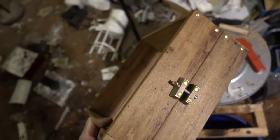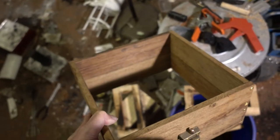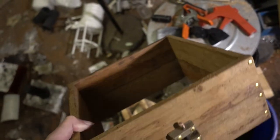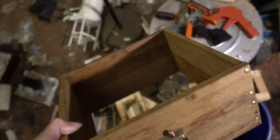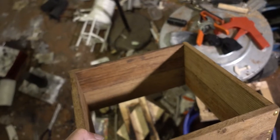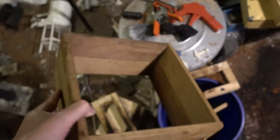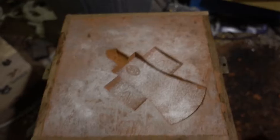I also found a paper from a Japanese technical university, where they did some research on how the nitrogen content in the system influences that, and up to 0.2% it's actually beneficial to get a little bit of nitrogen in there, and after that it makes the material a little brittle. So I will make a fresh batch and hopefully that will keep the nitrogen in the alloy in the beneficial region.